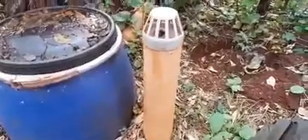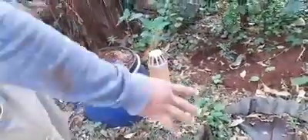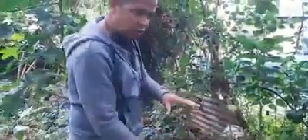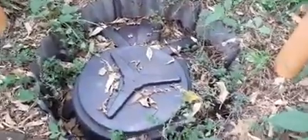That orange thing with the gray top — in case you have any blockage between the separator and the digester, we have a plunger tube. You just use a normal sink plunger, plunge it up and down, move the air, and that moves the liquid and will clear any solids causing a blockage. It's not a breather pipe — it's a plunger tube.